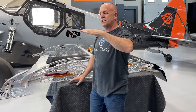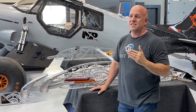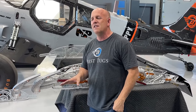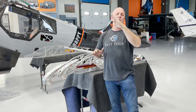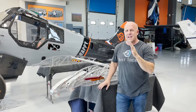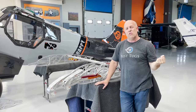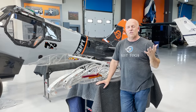So it'll be really interesting, because what I was able to do was check the X and Y drag coefficients on the flow analysis, and I could see that I can get to the point where the wing no longer carries the weight of the aircraft, and it's going to start sinking. And that's even with high power. You can just keep going, and it just keeps sinking, rather than what it would normally do, which is get past critical angle of attack, stall, let go, drop a wing. So it'll be really interesting to see, because the amount steeper it went while staying in aileron control was so staggering, it's hard to believe. So we just gotta try it.